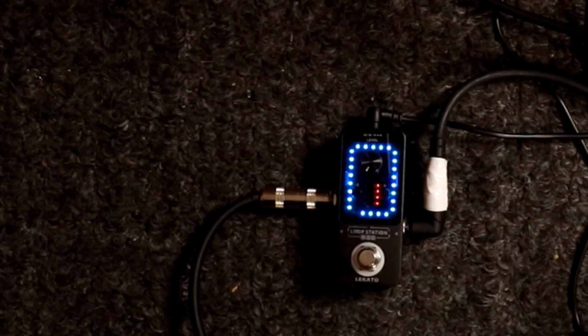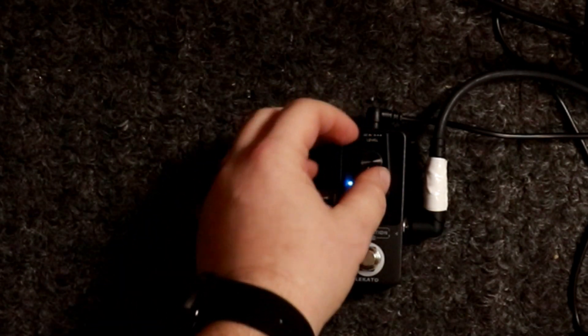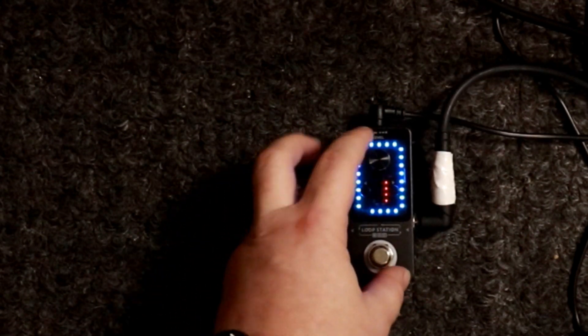Now you can hear — because I'm in front of all this stuff — that as I turn the volume down it's kind of like turning the volume down on the guitar rather than the entire loop. We basically want unity gain here so we get the closest reproduction of our guitar sound, and then we can mess with tones on the amp or pedal. The loop keeps going and allows us to do that without playing — so put it at midway, adjust some knobs on the amp, and you'll hear the amp change while the loop keeps going.